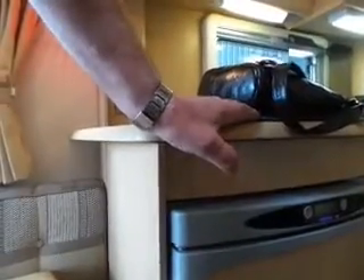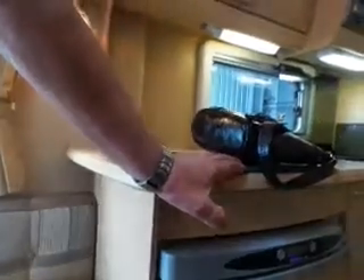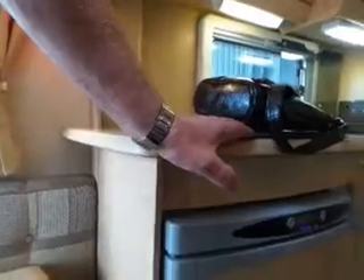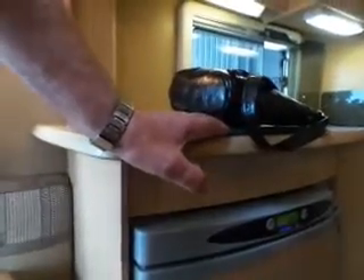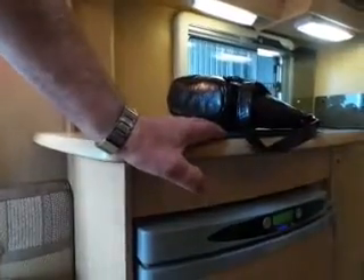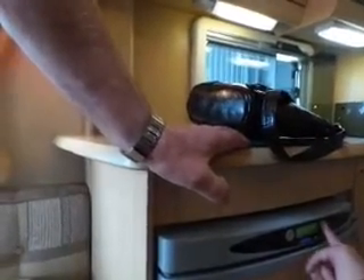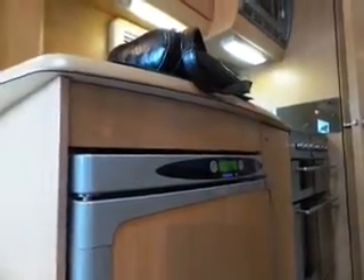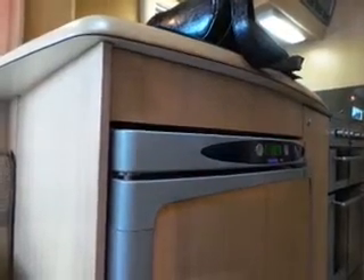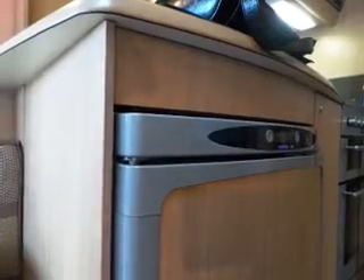Make two or three attempts. If you've got a solid blue light it's lit — you can just hear it very gently. For your temperature range, all five bars lit is the coldest — two or three is probably about right. Gas is more efficient for cooling the fridge than electric, so in a really hot climate it might be better to run it on gas, especially if you've got medication.